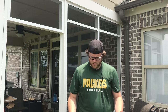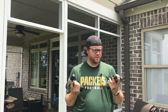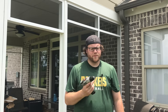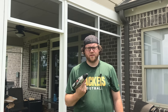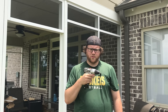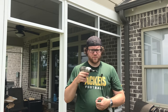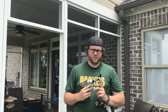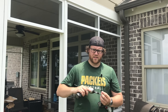When you're putting these on, my recommendation is to use two drills, or a drill and an impact driver. This makes it go a whole lot faster than having to switch bits. Even though it's pressure treated wood, you can usually drive a screw in without splitting the wood. I recommend using a drill bit so that you can get your hole centered in the slot and drill it straighter. If you try to drive the screw straight in without pre-drilling, it starts getting wobbly, especially since, as I said, the exterior screws sometimes don't have as much grip because of the excess material on them.